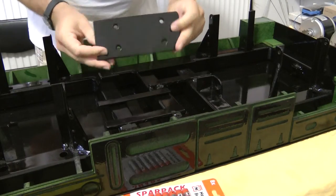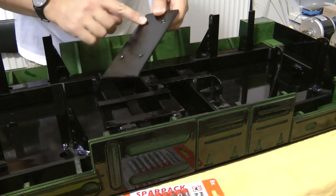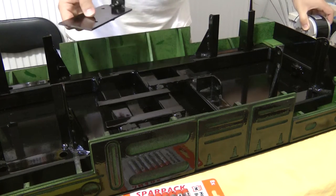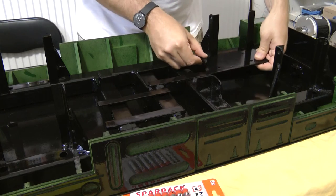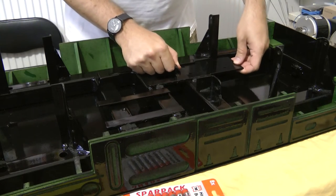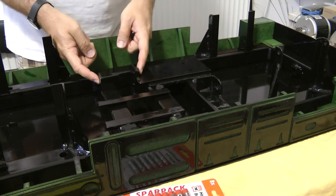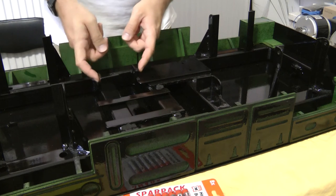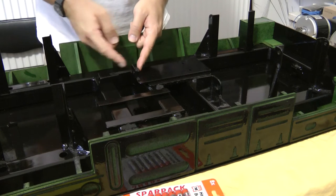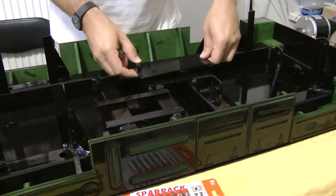Just to show you the mechanism — this is the plate, a new part which has been fabricated. It has some countersunk holes, and all the motors mount to this plate like this. Then it goes into these guides from the front. It's a little bit tight at the moment with the paint and everything. Basically it's going to sit like this, and a piece of M6 or M8 is going to hold it, and with the two nuts around here you can adjust the position and move it back and forth. This plate is going to slide in these guides.